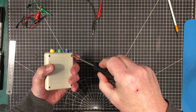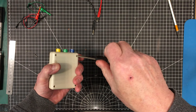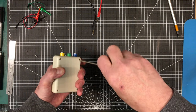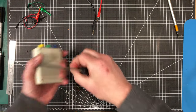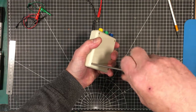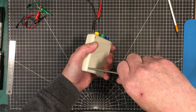Always worth repeating when you're putting plastic screws in: back them up until you feel a little click so it falls into its thread, then do it up barely finger tight. You don't have to crank down — I've seen so many plastic cases ruined because somebody put a hundred pounds of torque on the screw. It's just absolutely not necessary.